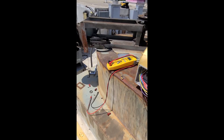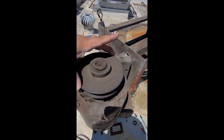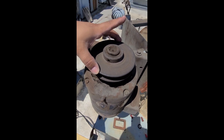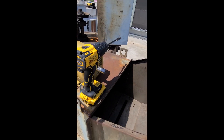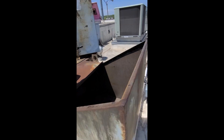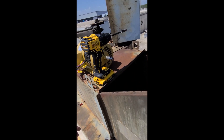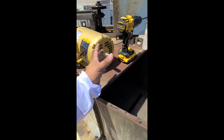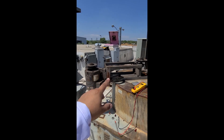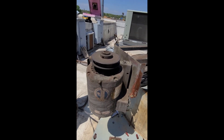You want to match your pulley size. Get your shaft size and then your pulley size — this diameter all the way across, and halfway to the center is your radius. I measured four and three-quarters, and the parts guy corresponded that to the pulley I have. You want to make sure your pulley is going to be the right size, because the belt has a fixed length from one pulley to the other and that will affect whether your belt will work.